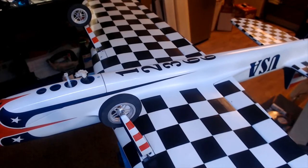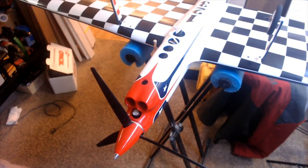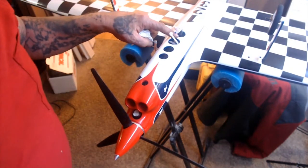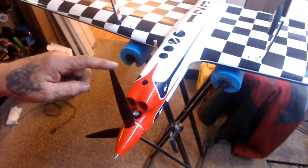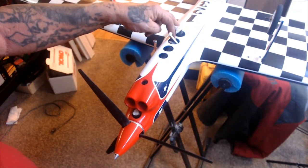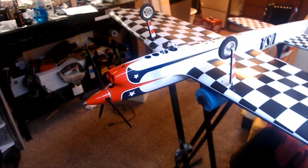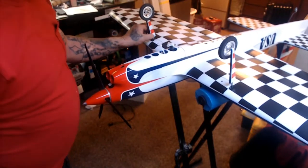So, if you go back and look at some of my older videos, I showed how I did this. I just carved it in there, the shotgun, and then instead of having just one big hole, we got all these little holes here, same amount of area. Supposed to have 2.5 times more going out than coming in. So I got two holes there. That's two, and way more than a half. So I got 3 times the amount going out, maybe 4 times the amount. So that'll cool really well. Yep, got a spot right there. I didn't miss.